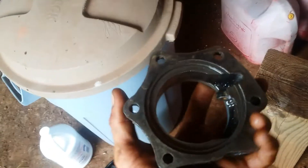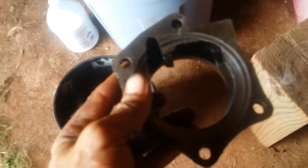Here is the back of the transmission where that seal goes in this big hole. I've already removed the speedometer drive gear, which took a 7/8 socket and just unscrews — be careful, it comes up in two pieces. What I've got to do now is take a wire cone on an angle grinder and clean this up real nice. The seal pounds out this direction, it comes out here.